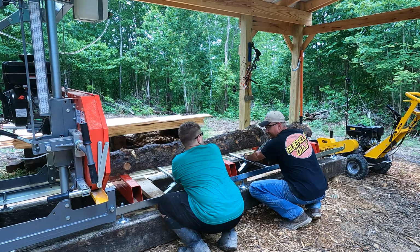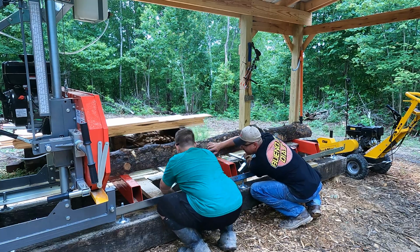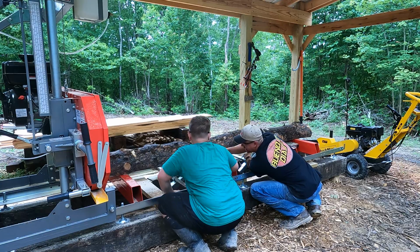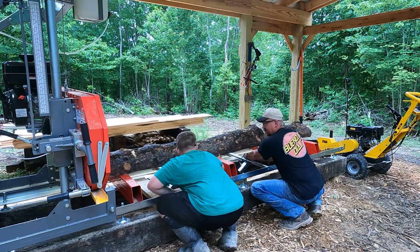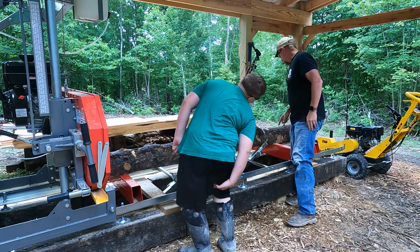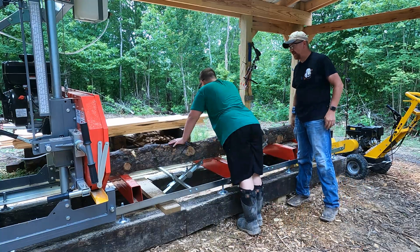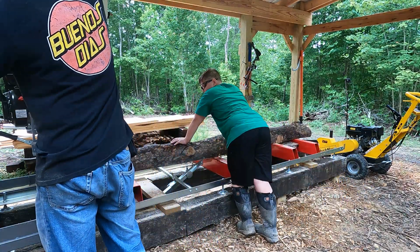You gotta have this opened up, okay? Open that to the top, push the bottom of it in as far as it'll go, okay? Now, pull this down. Now, latches are in. Cool? Now you kind of do a walk around, make sure that your log stops and your log dogs are lower than where you're going to be cutting. We'll lower the head down a little bit.